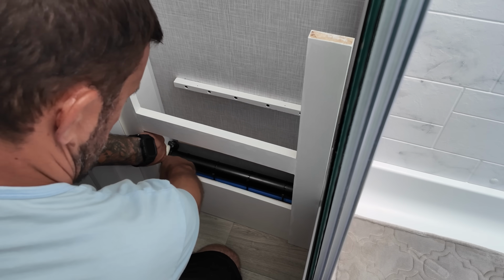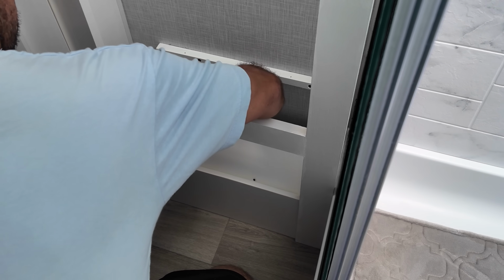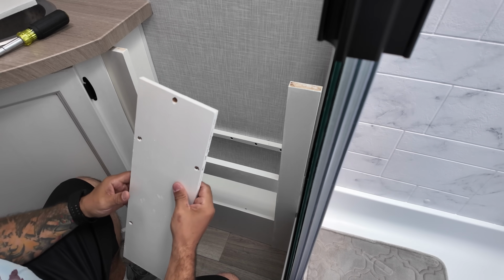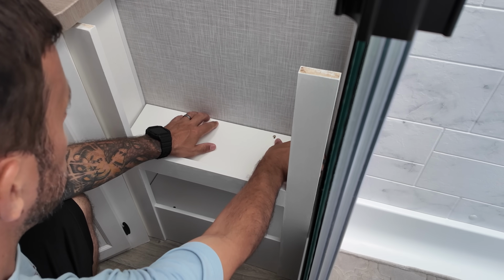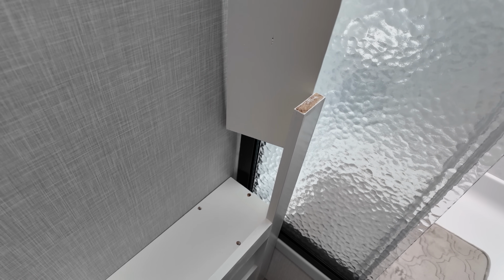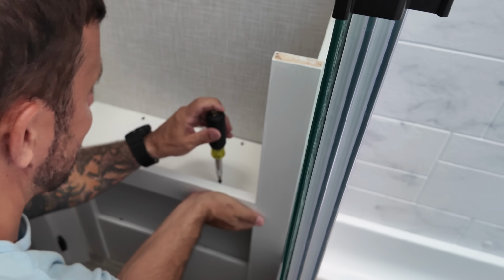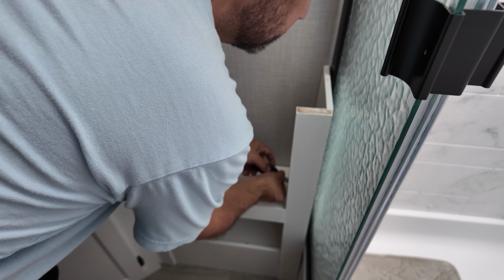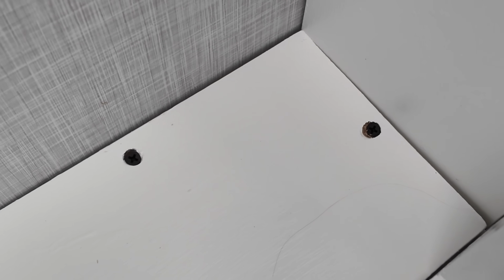After that, let's drop in the bottom shelf and for the last time, get the screws installed through the shelves into the supports. Once the bottom shelf is tight, go ahead and drop in your upper shelf, but don't install the screws yet. Instead, also drop in your side piece, which will be a little bit easier to do if everything on this side is still a little loose. Once the side is dropped down and resting on the bottom shelf, you can insert the 4 screws through the upper shelf into the supports, as well as the screws that angle into the side piece. Okay, everything is together. We are not perfectly square, but not too bad considering I used a jigsaw and nothing that a little drawer liner won't hide anyway.